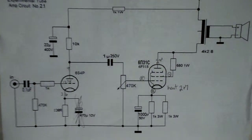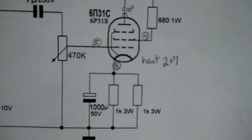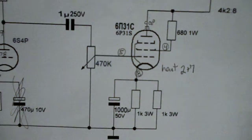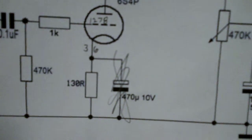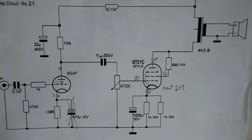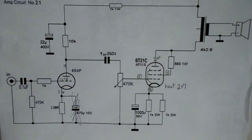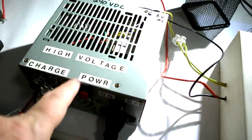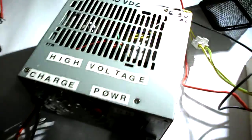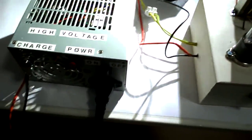They're either still in production or there's so many of them out there that they're super cheap to get a hold of. I used this schematic and I am able to make this work. Here's the 6P31S setup right there. The difference is this is a 220K rheostat, not the one you see there, and I also removed the cathode capacitor for the triode. Otherwise, this schematic is exactly the way I've got it here. We're going to put a little over 300 volts in it with my tube supply, which uses an EZ81 Tesla vacuum tube. So this is an all-tube setup — totally tube, no solid-state components at all.